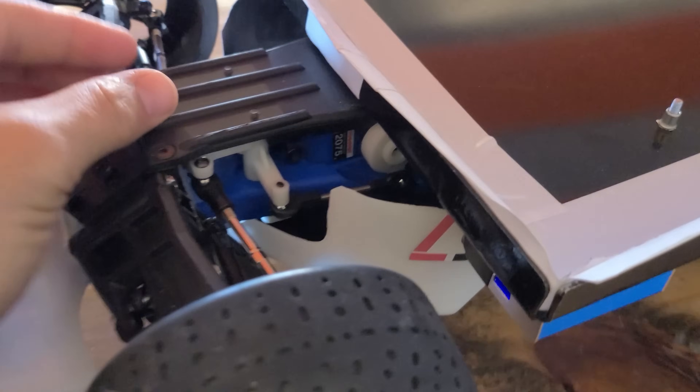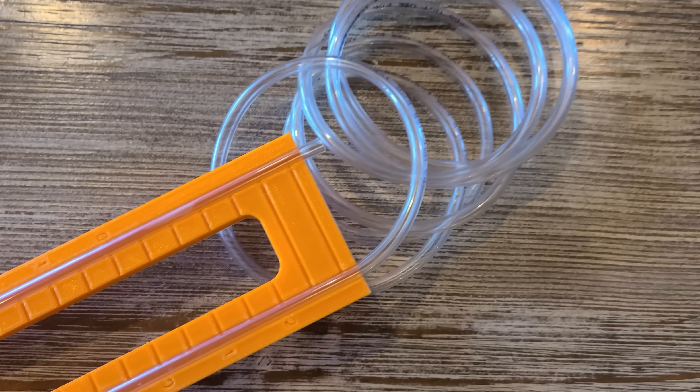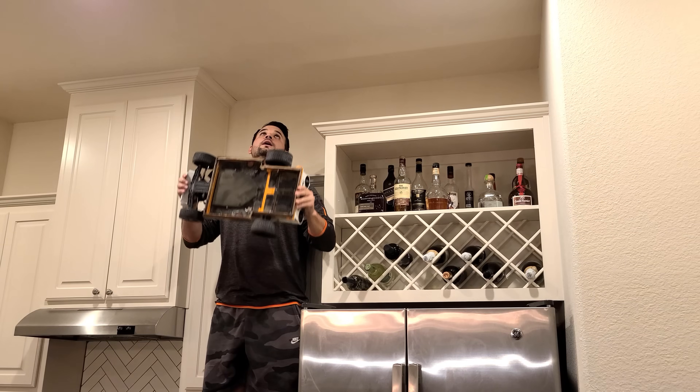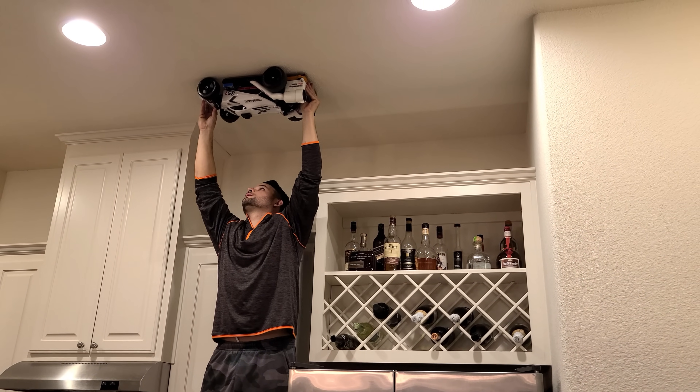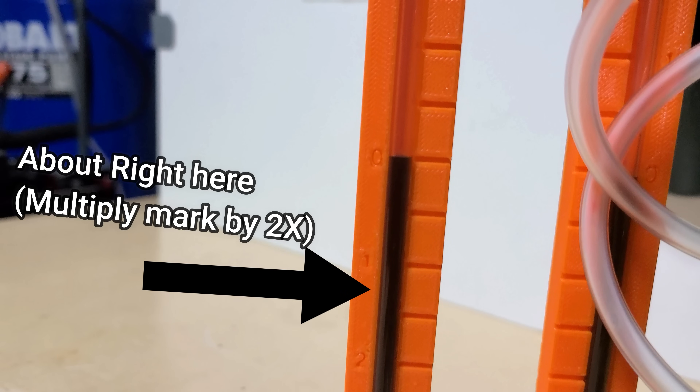And just like that I knew I was on to something. I also realized just how incredibly sensitive this car was going to be to the condition of the side skirts, and I really needed a way to measure this impact of side skirt position. So right before I was about to spend way too much money on a digital gauge, I remembered that I could just use some cheap tubing and a 3D printed housing to create a pressure measurement device in the form of a U-tube manometer. I should also mention that I had a very specific pressure drop target going into this. The car itself weighs about seven and a quarter pounds, and if I wanted to drive upside down it has to be able to support seven and a quarter pounds plus a little bit for wheel friction so it can actually move. My area of the under tray is about 120 square inches, so I was left with about 0.083 psi of pressure drop average across the bottom to get the 10 pounds of downforce that I needed. For reference that's equal to about 2.3 inches of water on our new U-tube manometer. Let's get an actual reading to see what kind of pressure drop we are getting.